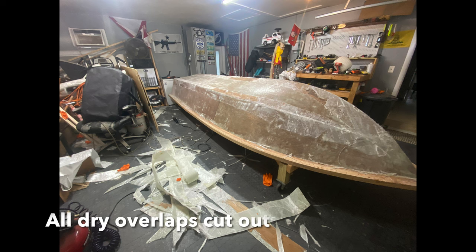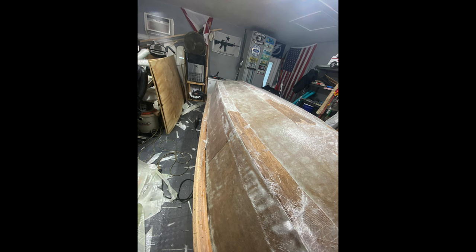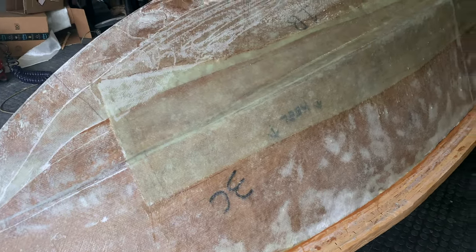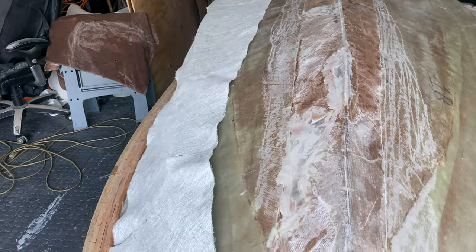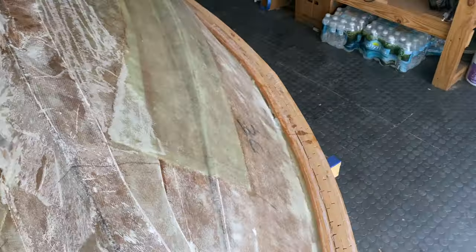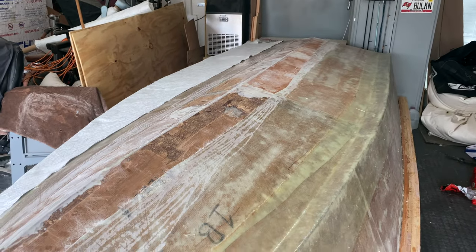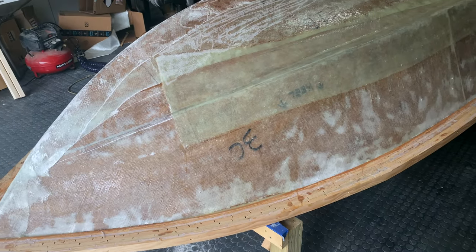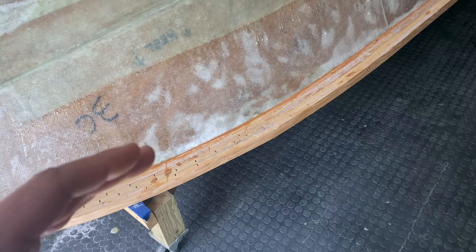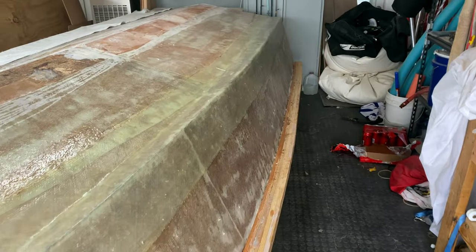What did I do? I've done two-thirds of my problem — fixed it. There's the centerpiece right there. Just got to wet this out, wet the centerpiece. I've laid the fixes on the sides here on these chines. And today I want to finish the middle chine here of the hull. It's a beautiful 50 degrees down here. I purposely left that dry because I have to fill this little gap here between the rub rail and the boat. I'm going to end up putting epoxy and probably a piece of foam in there to create more of a flare out to about the second board rather than it being a straight 90-degree angle. These turned out spectacular compared to my original pours.